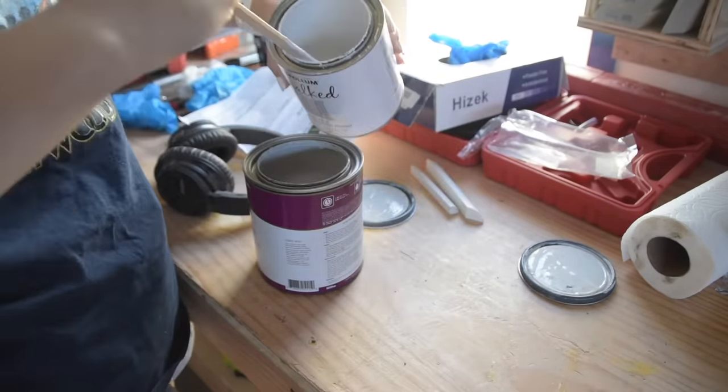These going up on the wall really truly brought the room all together and took away any of my fears. Some of the pieces didn't quite fit when I put them in the wall, so I had to trim down one or two of them, but ultimately I did really well in my measurements, except for one little corner you'll see in a second and I'll show how I fixed it. I am always gonna recommend though for these kinds of things when you're cutting wood or cutting trim, measure 2, 3, 4 times and then cut once, because once you cut it, you can't really go back.